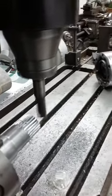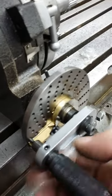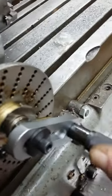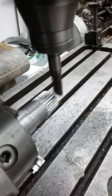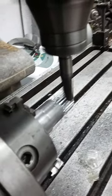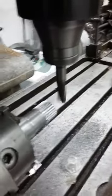So that's the next cut — we back out the way. Move the fingers round so that the start finger is against the detent again. Pull it out three turns — one, two, three — and then get the 12 holes, which is round to the next finger. Then we're ready to take another cut. It looks like I've been all the way round because that's just grazing the teeth, so I think that job's done. We'll see if it fits, and if it does, we'll record another video. Thanks a lot.